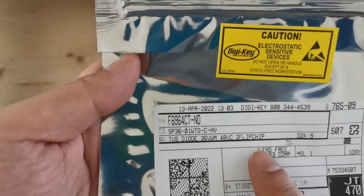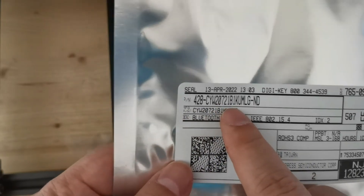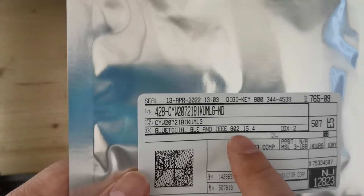This one here is for my hearing board and this is for electrostatic protection. This is the Cypress 20721 — it's for another Bluetooth board I want to make. The good thing about this one is it supports dual mode: Bluetooth Classic and Bluetooth Low Energy. This chip is also quite powerful — it has a 96 MHz ARM M3 core inside and a lot of peripherals. It provides a complete SDK and a lot of examples for users, so I decided to try it out for the dual mode.